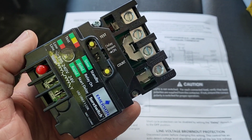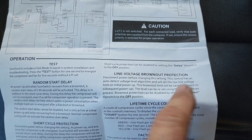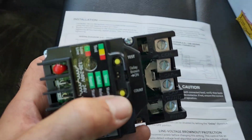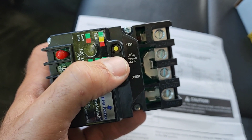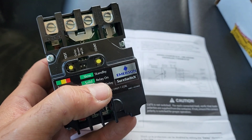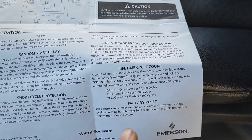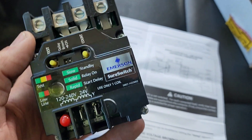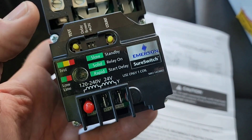Because this is an electronic contactor, it's got a built-in algorithm that protects from brown outs, and we can read about it in the manual. With the random startup delay and the brown out protection, we have two dip switches that we can turn on or off — just change the position to the left. We can also check our compressor cycles using this button, and the manual shows instructions. It rounds off to the nearest hundred cycles, so we can go in after a year or two and see how many times our compressor has cycled.